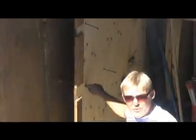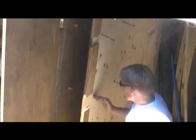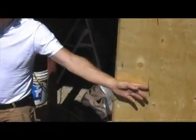Over here, we're using conical snap ties. These are more designed for a commercial series pour. In this particular case, I had some. I want to use them up. These work a little differently, whereas these use a steel whaler bar going through. Over here, we drill through.